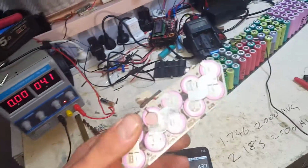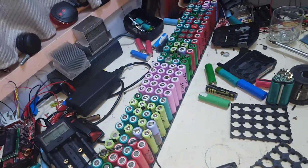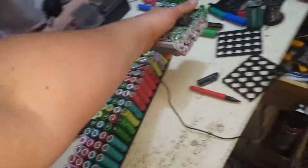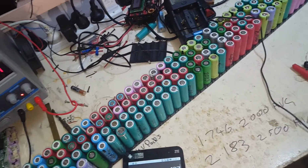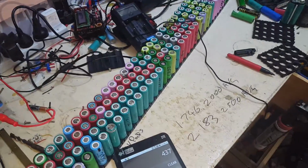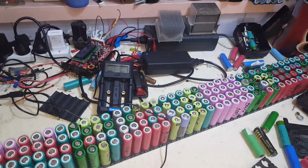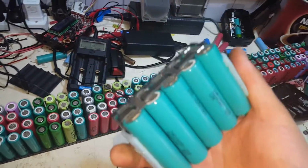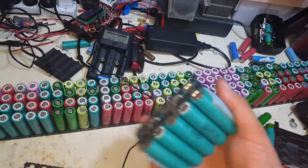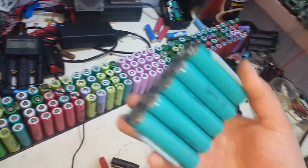Now, when you get batteries like these, this was a 6 amp AEG. You get 3 amp hour battery cells out of it. Exactly what, 2 of them are there. There's a handful of other similar ones out of laptop cells. So this is good, but sadly, heaps of cells will miss out. Unless these test above 2K, they won't go into the pack because they drop the average. So if I've got 10 of these and 10 of these, we've still got 2.5 average. Because they're 3000, these are 2000-ish, either way.